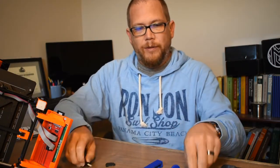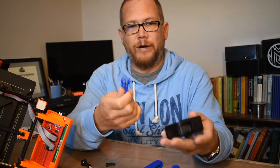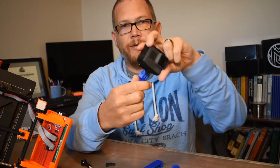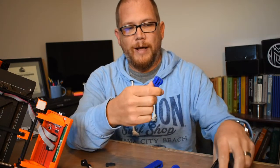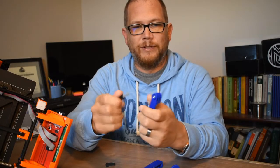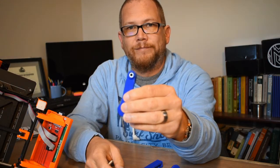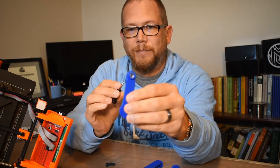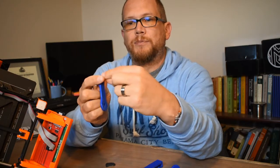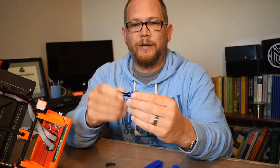One of the things I did on this arm mount — so this is the arm and the camera mount itself slides into the ears. There's a hole through here. This is the screw that comes with the original mount, and there's a threaded piece on that mount that this threads into to tighten it up. What I've done is I put a hole in there for the size of an M5 nut, because this is a metric five-millimeter thread. I put a nut in there, made a little spot — you just push the nut in, it's a little tight so it holds and stays. Then the screw slides in and threads into the nut. It works pretty well.